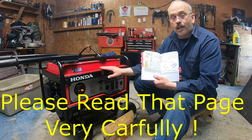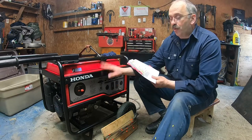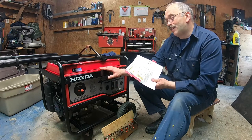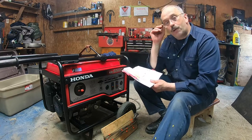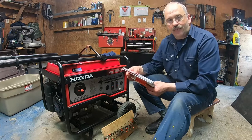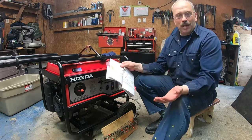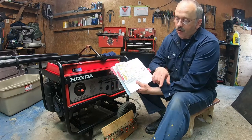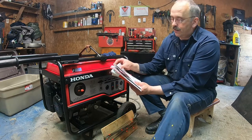By the way, I change the oil every 24 hours, no matter what, all right? By the book, at the first 20 hours you do the oil change, and after, they say it's every 100 hours or 6 months. Well, sorry, as my stepfather was telling me, change the oil every 24 hours, you will have that engine for life, and use synthetic oil, all right? So that's what I'm doing, and after 11 years, I think I'm doing pretty good. Then they're talking about the spark plug and everything, and I'm going to show you that in detail, okay?